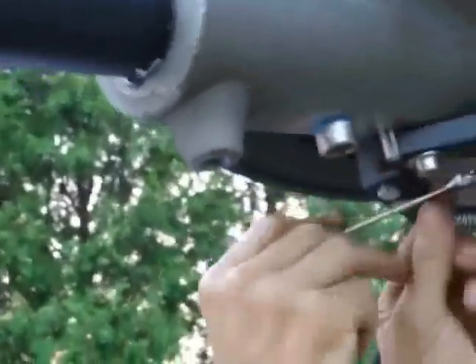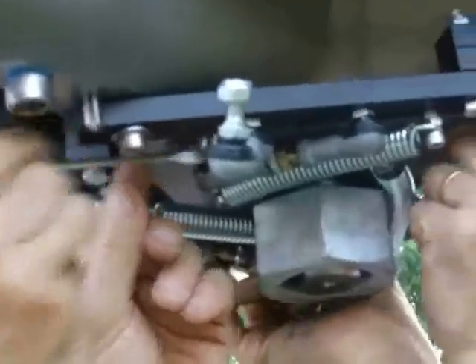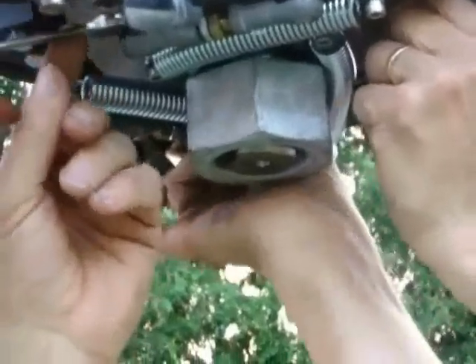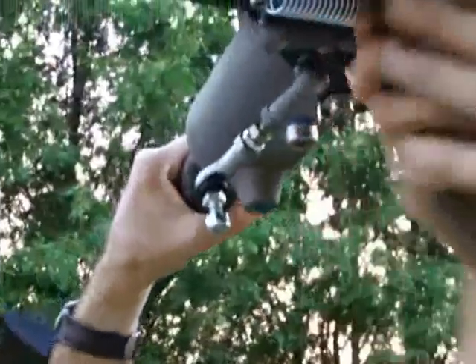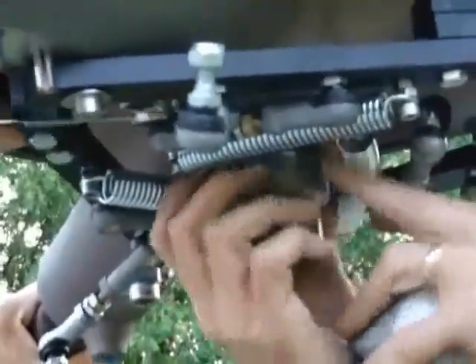In the past when the blades have been put on, they've had to have a downward pressure on them. This time we used upward pressure — that was our own feeling on how it helps. It's not quite so important on this new one because the holes in the hub and the shaft diameter of the blades was a much better match than the previous version. Notice we still have the big nut on there — it's a safety thing when we were putting the rotor hub on, and it'll come off shortly since it's actually bearing on the springs anyway.